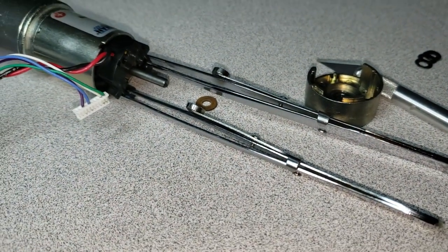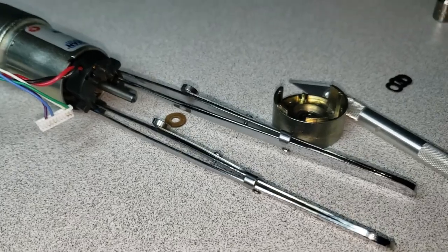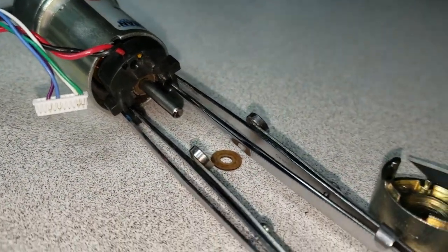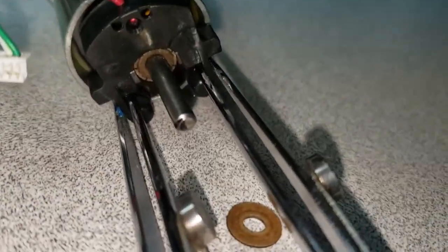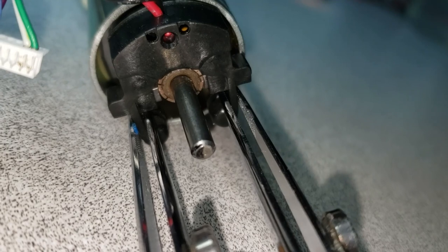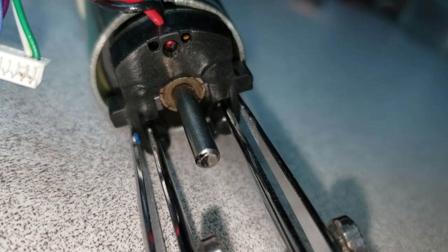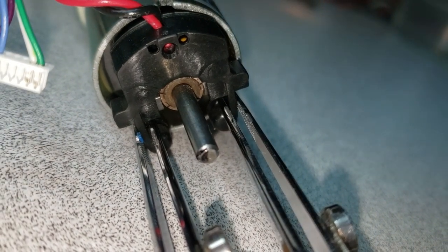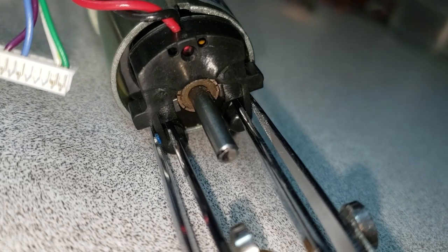I have these two pairs of excellent locking jewelers' tweezers that I got 30 years ago from a company that had a jewelry department and went out of business. I was able to grab those two springs and then use an exacto knife just to push the two commutator brushes back in and slip this over — so now it's where it belongs on the commutator. I'll slip the washer over it and finish the assembly.